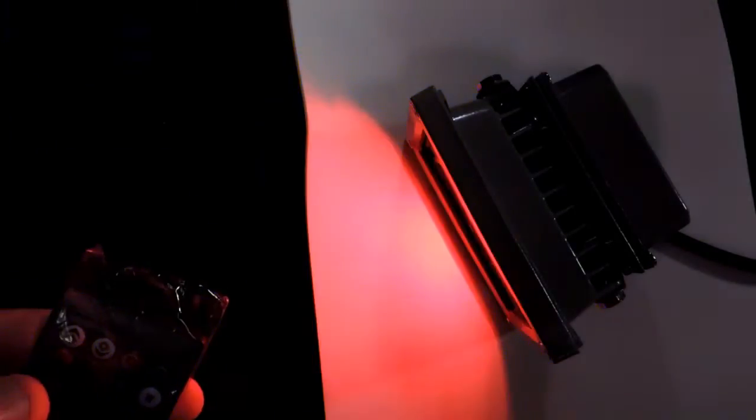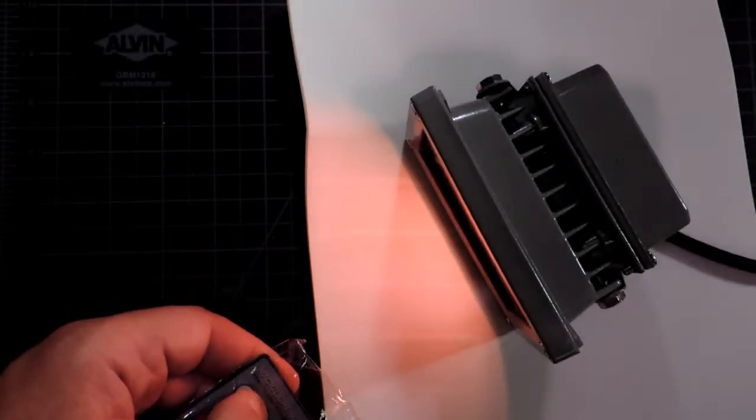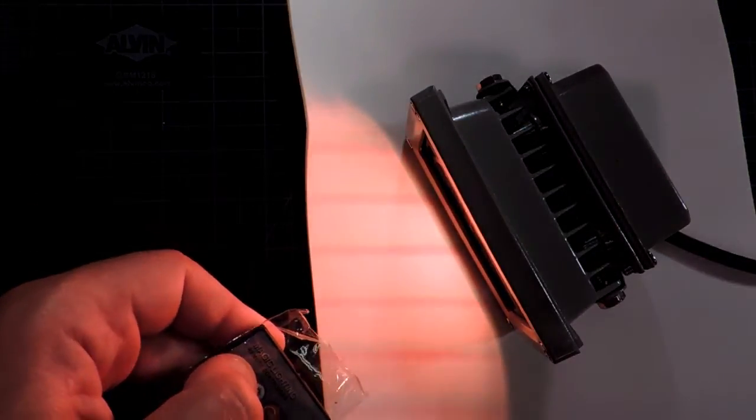You might see some banding on the shutter here. That's not actually visible to the eye — it's pulse width modulation. It has an intensity control and you can change the intensity. The camera, because its shutter speed is fixed, actually captures an alias of the pulse width modulation. We'll throw that on the scope to show what it's all about.